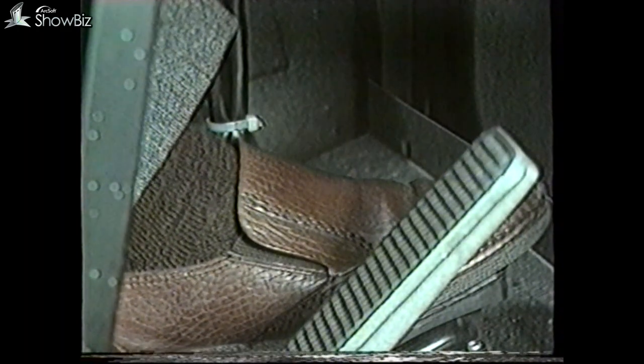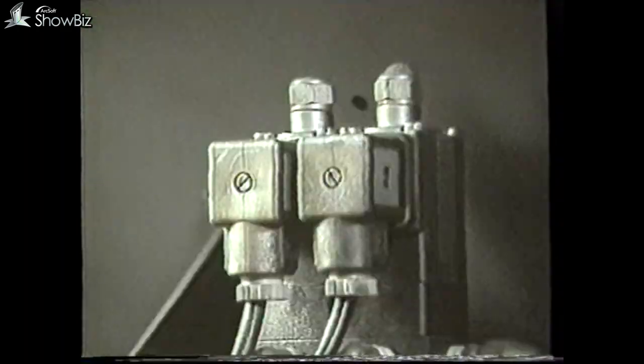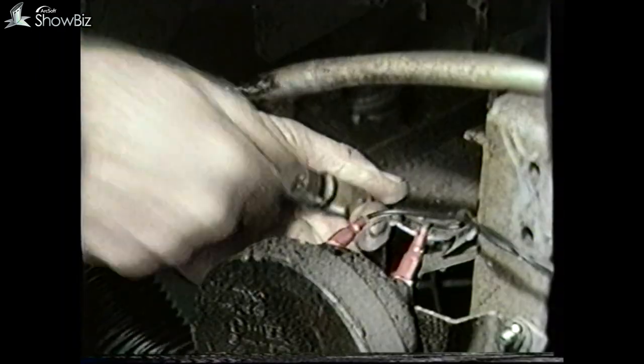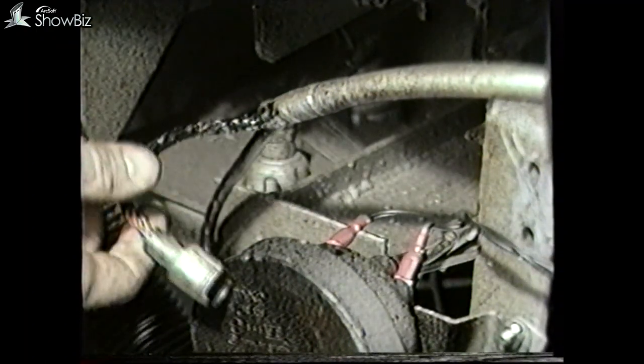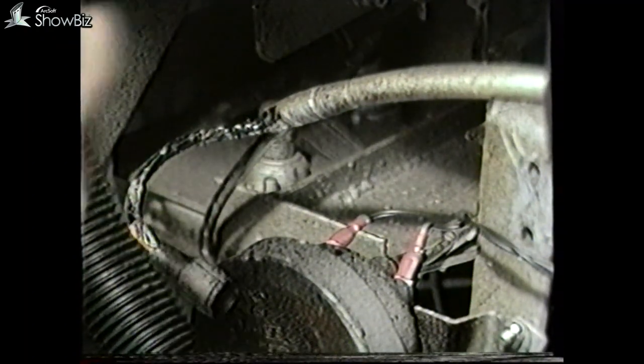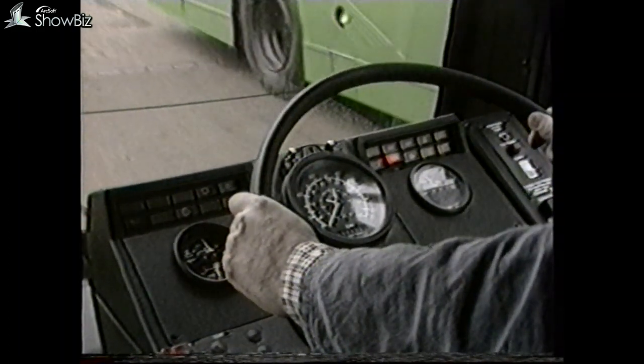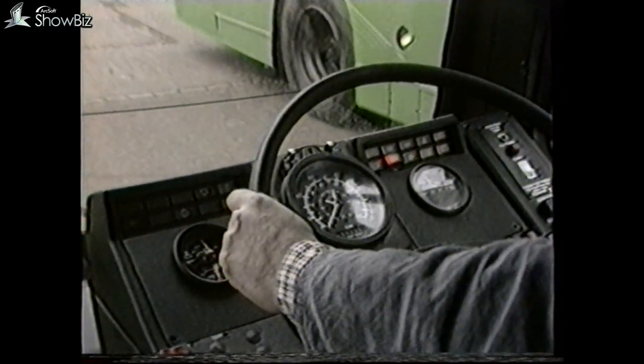If this condition of lock-up only arises when the foot brake is pressed, this would point to a problem with a special suppression diode fitted to the retarder EP units. These units can be isolated by disconnecting the cannon connector at the front of the vehicle. So if the vehicle functions correctly without the retarder switches or EPs in operation, and then fails only when they're reconnected, this points to a problem within the retarder diodes.